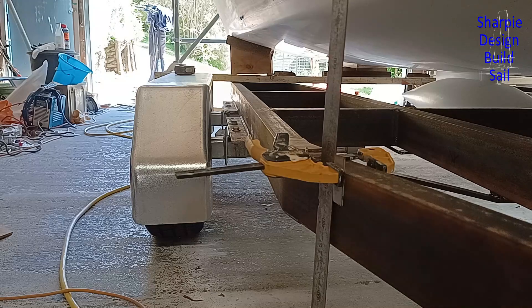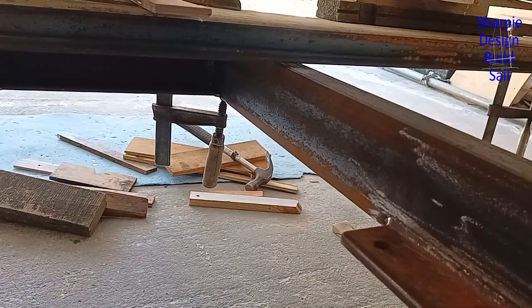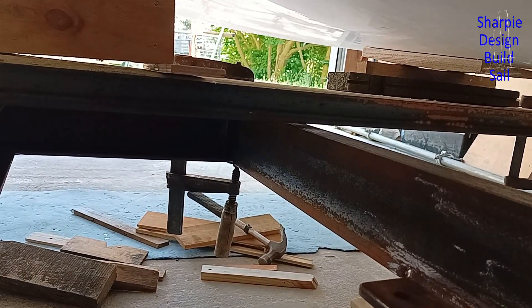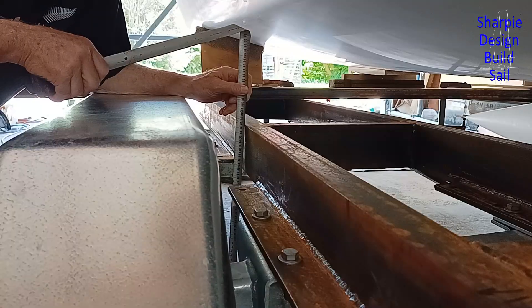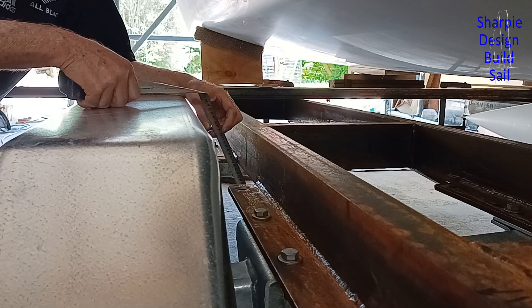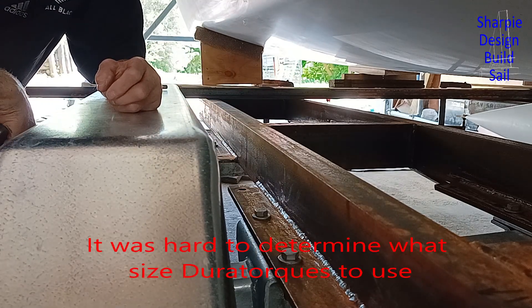That's the full weight of the boat and the keel sitting on the trailer. I wanted to see how much the suspension drops with the full weight on it. I can't detect any more bend than was there on the outside rail, but it looks like there's more on the inside. You can see the gap — it looks like about 5/16 — it's bending down. Before it was 472, now it's 455.